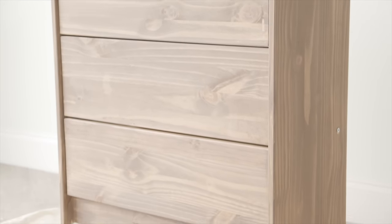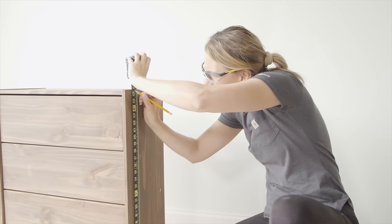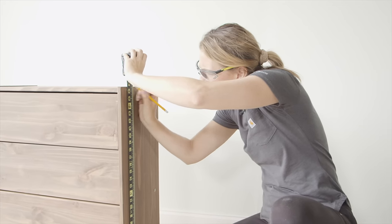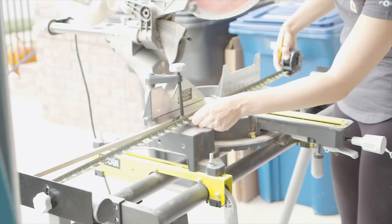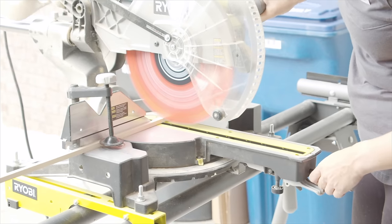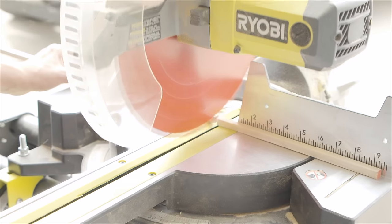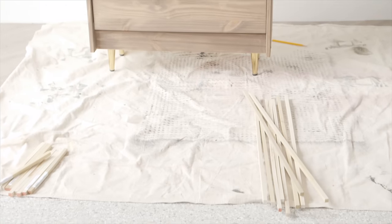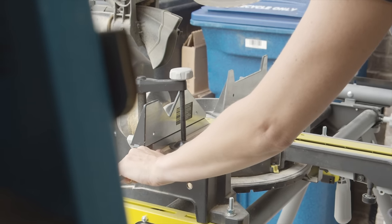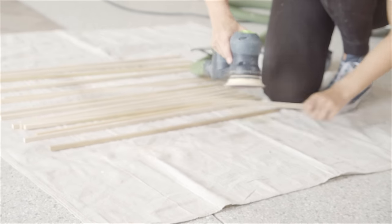I love the way the stain is looking. Now we're going to get a little more technical — I'm going to flute all the way around this piece using wooden dowels. I've marked off how much I need to cut, starting with the sides. I set up my saw to make those cuts quickly. I got these dowels at Home Depot — they were $1.76 a piece and I ended up having to buy 60 of them to cover the entire dresser. In hindsight I think I could find these in bulk for cheaper online, so keep that in mind.